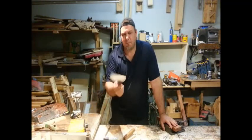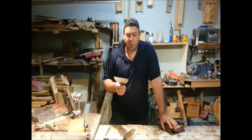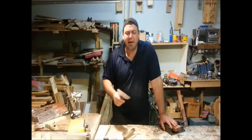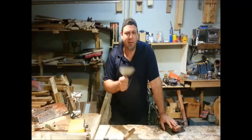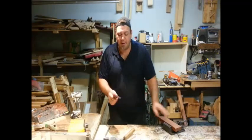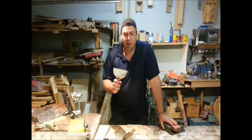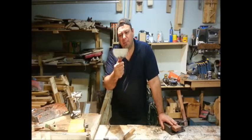The card scraper I used was made out of an old putty knife — this one right here. Lots of different materials will work: old saw blades work if you can flatten one side of them, and putty knives work great. Not all putty knives are equal — you want to look for at least a four-inch one that's got some flex, some spring steel, so when you bend it it pops back. The types meant for doing drywall are a good choice.